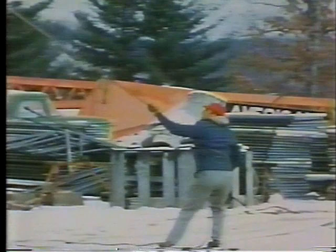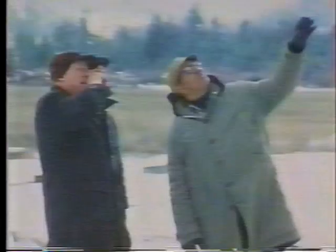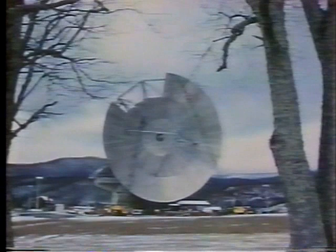The donut-shaped top is built to support 1,000 pounds of receiving equipment mounted on an adjustable feed support. The truss-stiffened legs will prevent deflection of more than three-eighths of an inch from wind or gravity under normal observing conditions. The vertical axis of this support, in line with an instrument support stand above the apex of the paraboloid, determines the focal axis of the antenna; all components are adjustable to assure the correct location of this axis with respect to the surface.